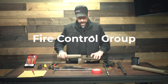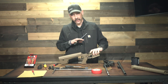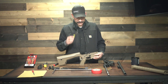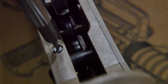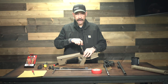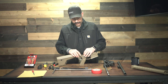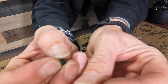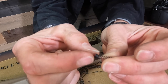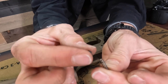There are a couple of little pins on here. Let's take the safety out first — I find it's easier to work on the trigger once the safety is totally out of the way. You're going to want to use a little tiny screwdriver tip; there's a little slot on top. Just unscrew that — kind of keep your fingers there because there is a spring under that little screw. You take out that little screw; it's got a little point on the bottom of it. There's also that little spring and then there's a little tiny ball bearing in there.